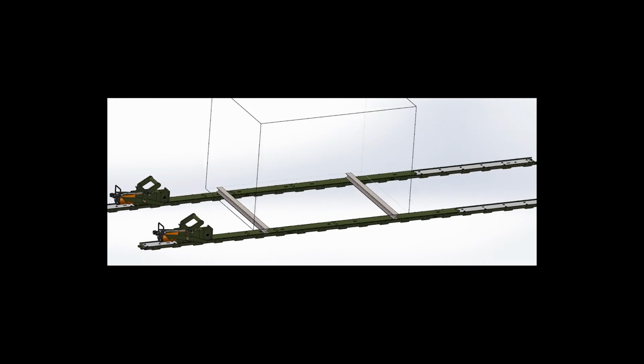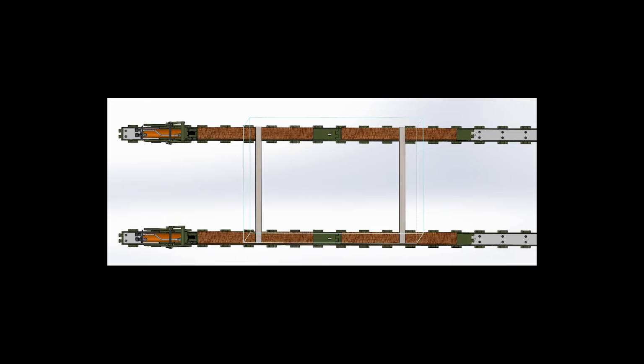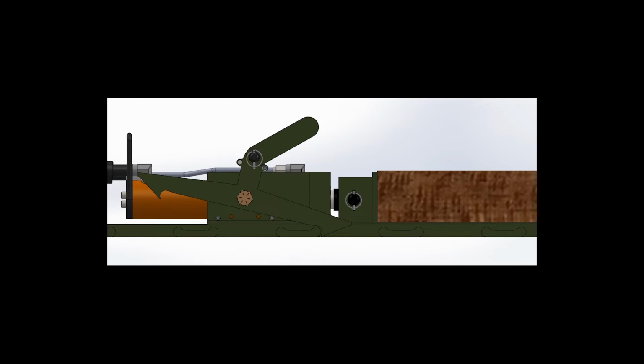Steel beams or plates can be placed between the contact points of the load and the skidding system, but one of the more common methods is to use wooden blocking for load distribution. Whatever method you use, just ensure that the distributing material is placed firmly up against the front face plate of the push-pull head, or this plate will bend when hydraulic pressure is applied.